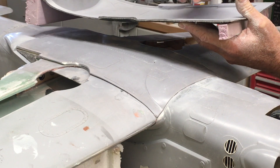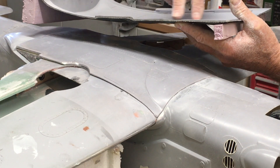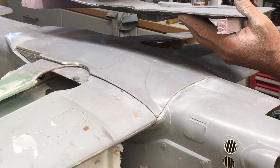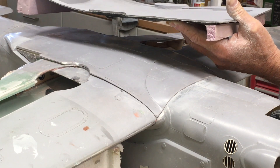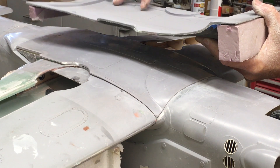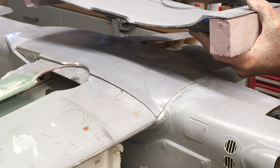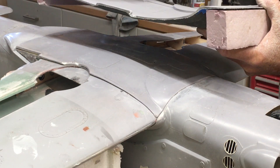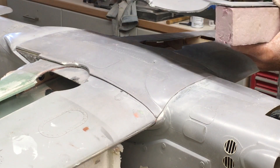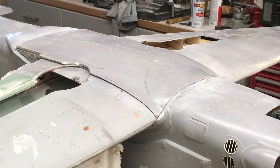I'm going to lay everything flat - a layer of cloth tripled up down the sides, laid flat right to the edge. Same along here, except for the bit I'm putting in for the pins. Then I'll lay three layers of 6oz all across here just beyond the hinge point so the hinges have a solid base to work from. That should give me a stiff enough speed brake - if not, I'll laser cut some reinforcement.